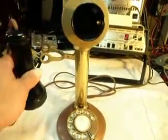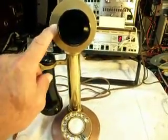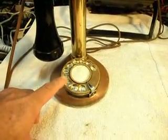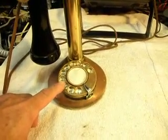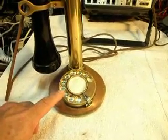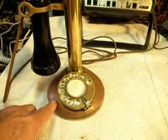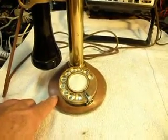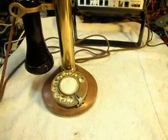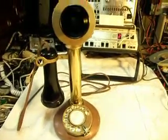We did some various repairs to this telephone. We had to repair the hook switch, do the funnel on the transmitter, go into the dial and repair the connections on the dial, clean them, get the dial adjusted to where it was dialing out properly, and repaired some connections. Where we could, we hard soldered some of the lines together so there wouldn't be any problems with anything falling off, any wires.